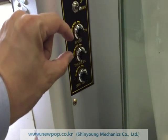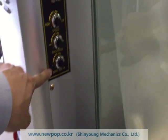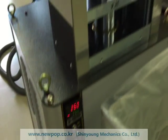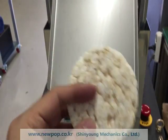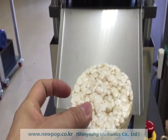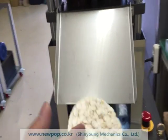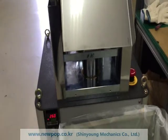The thickness of the cake can be adjusted — this is the core depth, the depth of the down mold. It also affects the bottom face or upper face. If we need a rough face, we adjust the core depth.